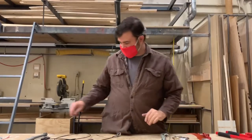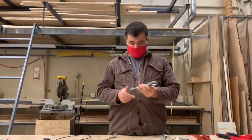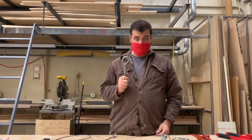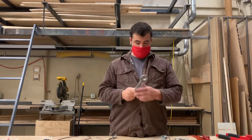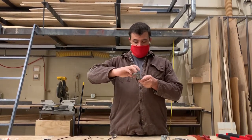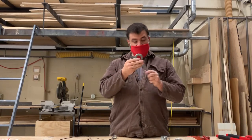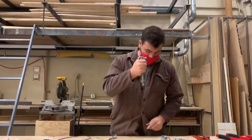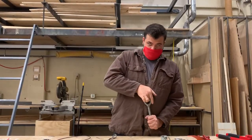Bottom hanging plates. The last two things: one is an eye bolt. The difference here is this is a forged eye bolt versus a cast eye bolt. The same concept goes — this would go into a piece of scenery, get bolted onto the back of it, and you can use it as a lifting iron.